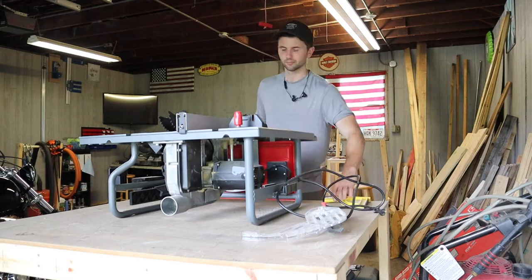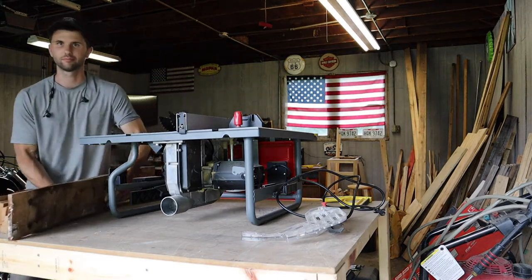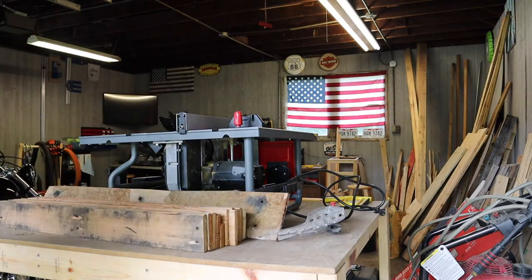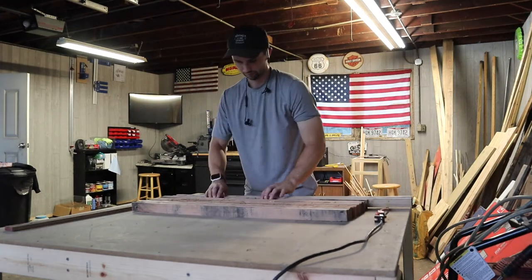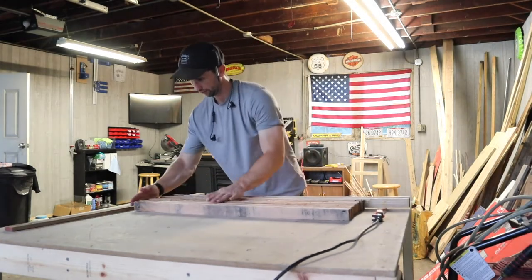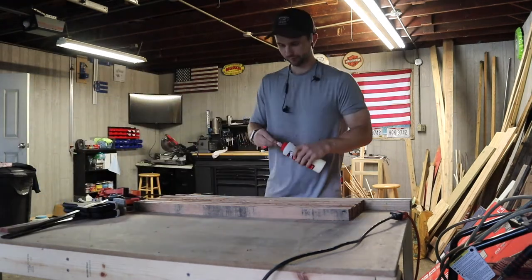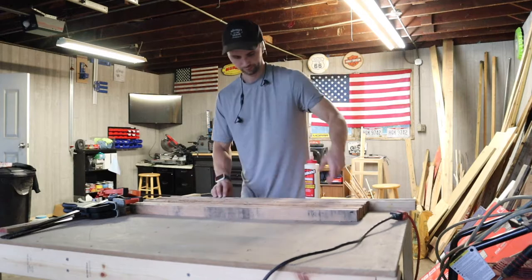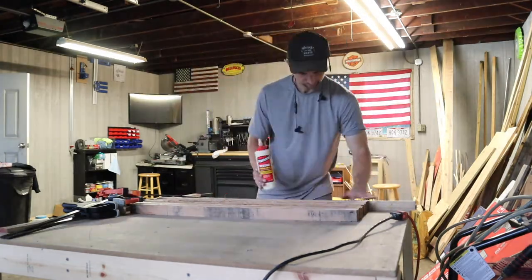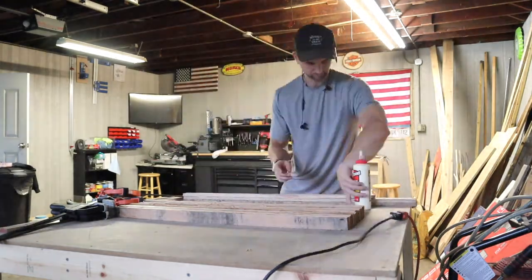To start out you're going to want to go ahead and get two large pallets — you can find these within your local area on Craigslist or Facebook Marketplace, they're pretty accessible. From there I went ahead and ripped these down into one inch strips on the table saw. Now that I have those one inch strips, we're going to go ahead and glue these up. I recommend using a good amount of glue here, because if anyone were to sit on this or put large decorations on there, we want to ensure a strong hold.